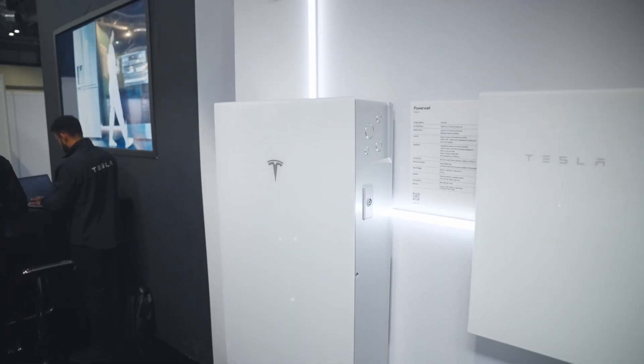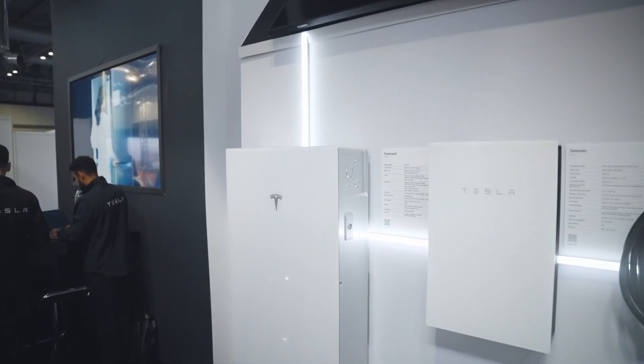The main difference between the two setups: without the gateway you still get all the functionality of the Powerwall 3 — charging, discharging, weather forecasting, all included. The only tangible difference is during a power cut. With the gateway, your power stays on as long as there's battery or solar available. Without the gateway, the Powerwall safely disconnects when the grid goes off and re-engages when power returns. If you're not prone to power cuts, you could skip the gateway, save money, and reduce your overall payback time. And if power cuts become a regular occurrence later, the gateway can always be added at a later date.